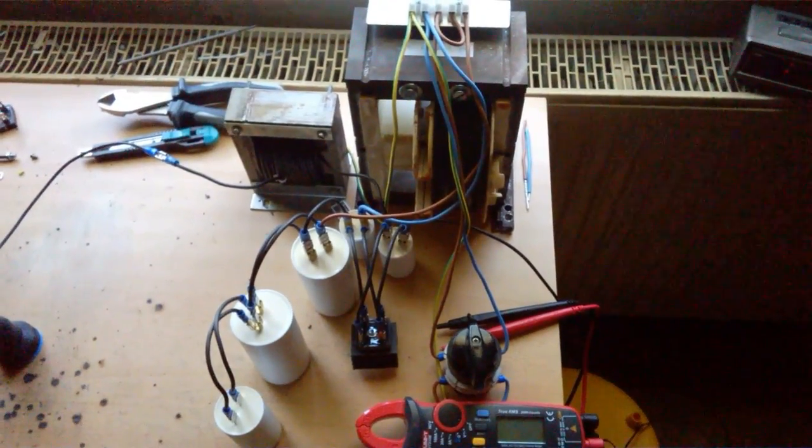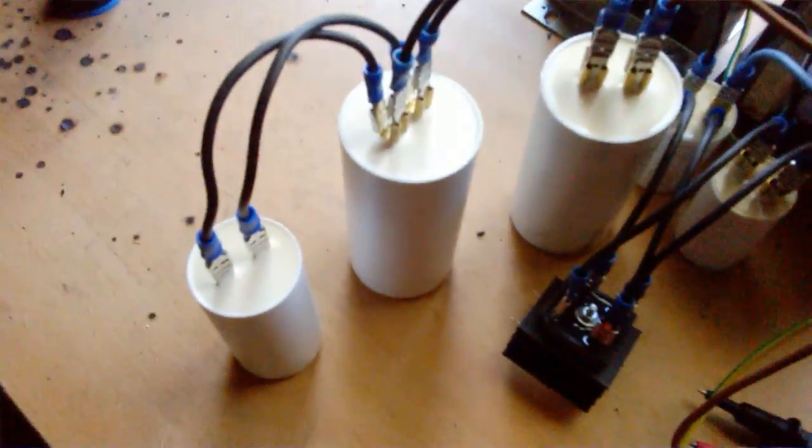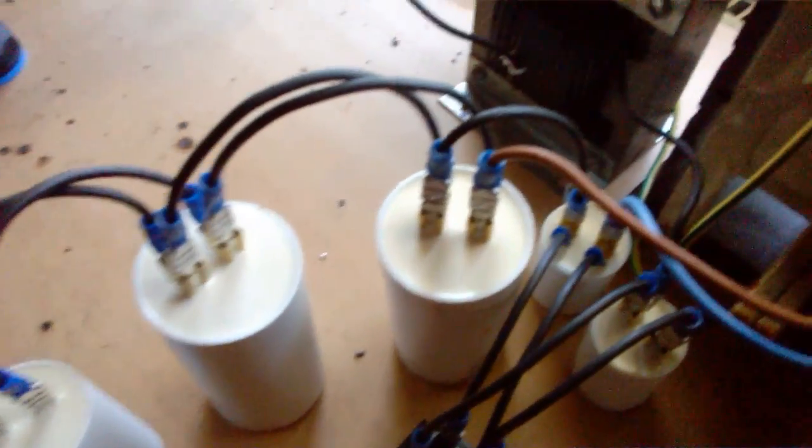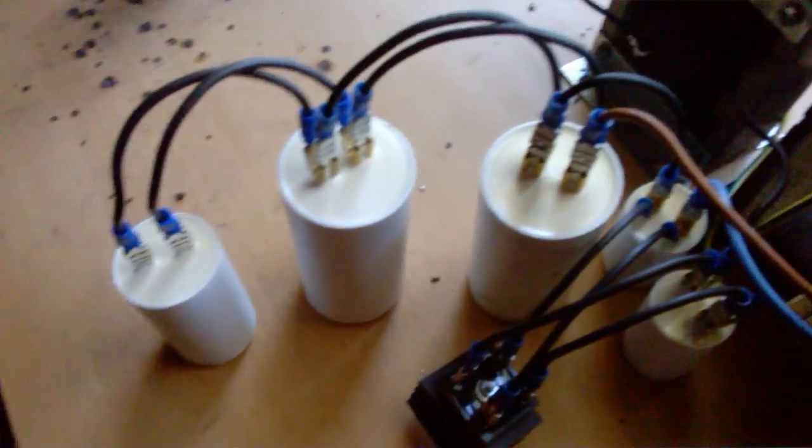Okay, first I will show you the setup. 240 volts coming from here into the switch, into the step-up transformer. From the step-up transformer into these capacitors, using them as a capacitive ballast,